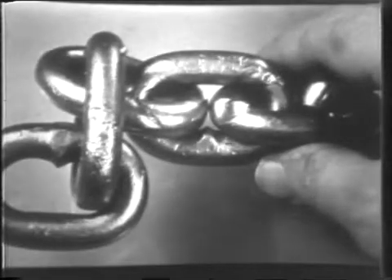Nicks and gouges, in most cases, occur on the straight barrels rather than on the ends. Since they are usually located in surfaces under compressive stress, their potentially harmful effects are reduced. We should note that the unique geometry of a chain link tends to protect tensile stress areas against damage from external causes. These tensile stress areas are on the outside of the link body at the link ends, where they are shielded against most damage by the presence of interconnected links. Tensile stress areas are also located on the insides of the straight barrels, but these surfaces are sheltered by their location.